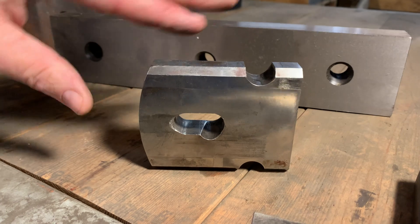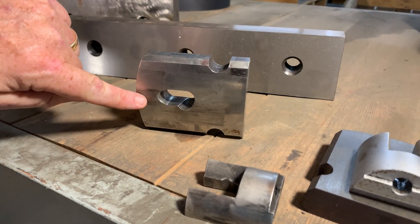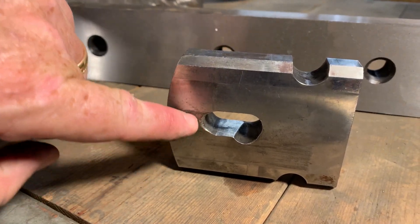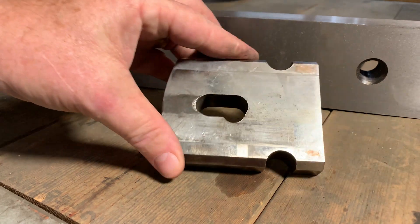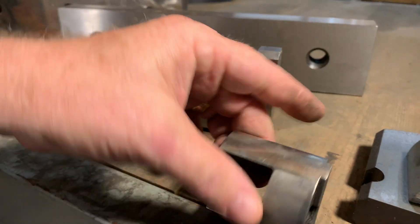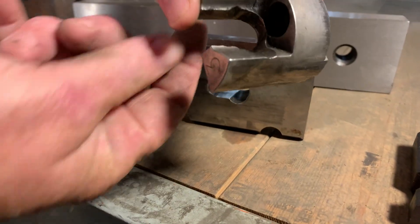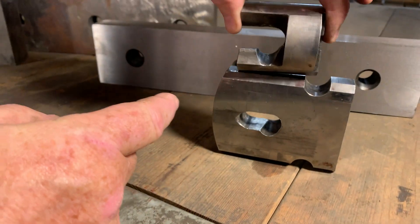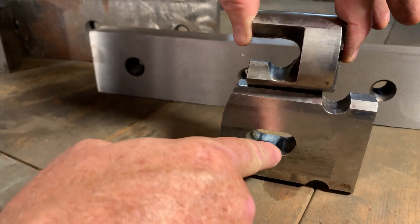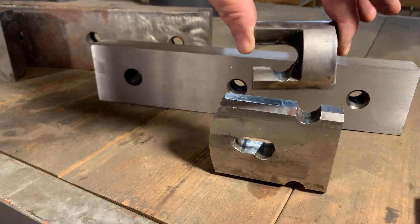Here's an example of an old legacy machine, a 1016. What we can see is the stationary blade — we've got the cutting edge here and you can see it's already kind of popped, it's not sharp. I could drag my fingers across this all day and never cut myself. This is the movable blade that would slide across it, and you can see it's not very sharp. Back in here it's actually got a groove across the bottom from all the steel wear over time. Same thing on the other blade — this is a blade that's way past its prime.